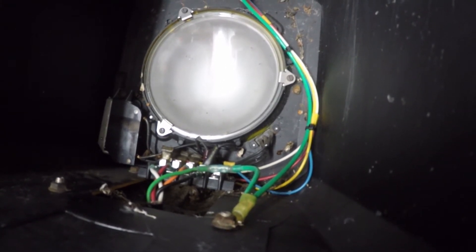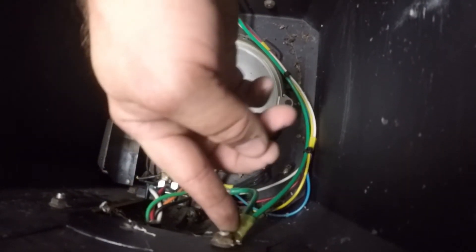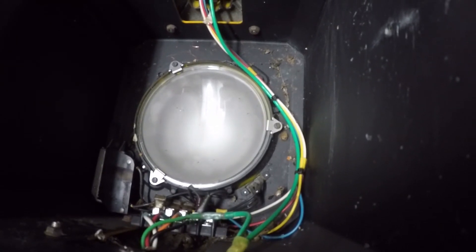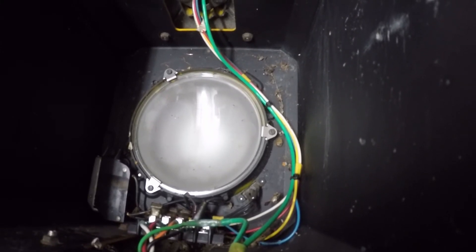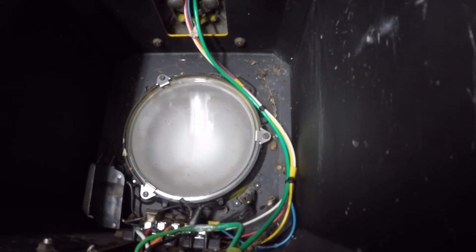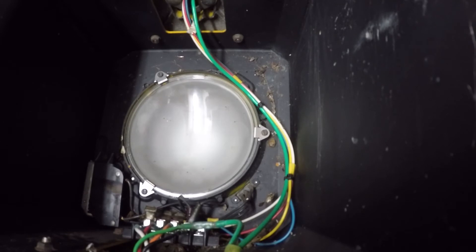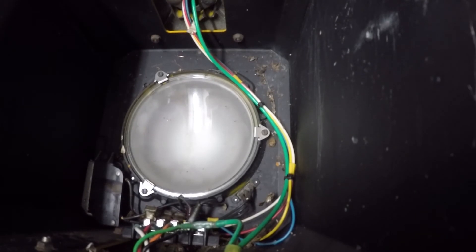I got the wiring hooked back up. As far as the grounding solution — you can see that I have the green wire coming in and it's terminating to the part of the housing right here, and I also have it running up to each individual housing above that. The reason I'm doing that is because you don't get a good enough connection between the housings through the bolts themselves, so there wasn't good enough continuity between each housing based on just that alone. I felt the need to run a ground wire daisy-chained to each individual housing to make sure this is safe. These weren't grounded whenever they were in use, but since this is more of a decorative piece and it's going to be low enough where people could touch it, I want to make sure there's no issues where there would be voltage on the housing again like there was earlier.